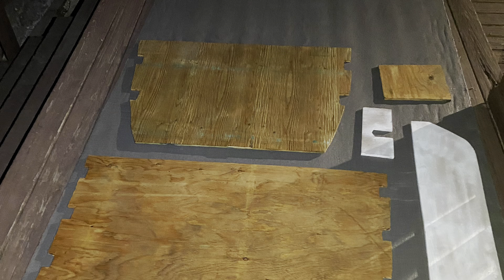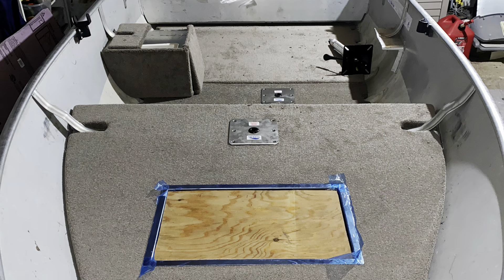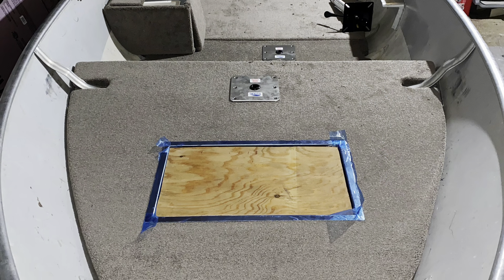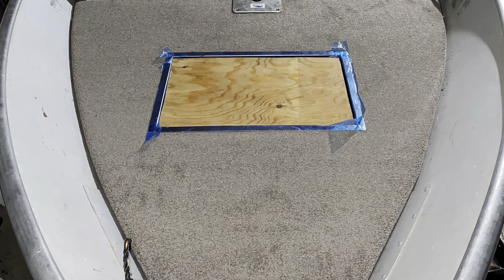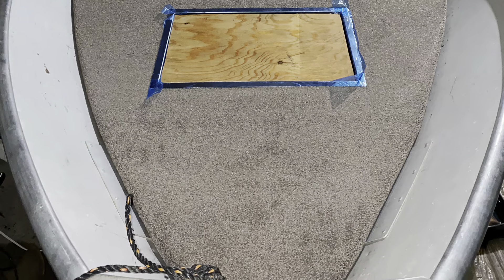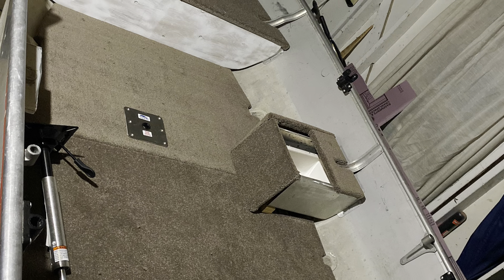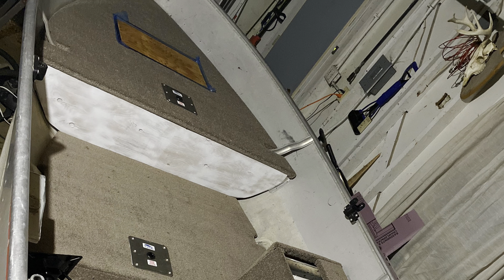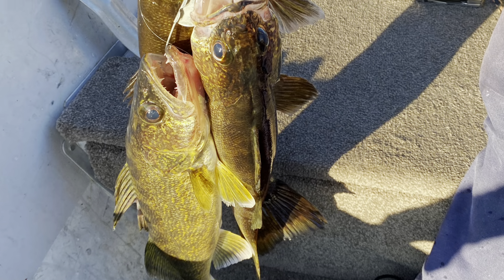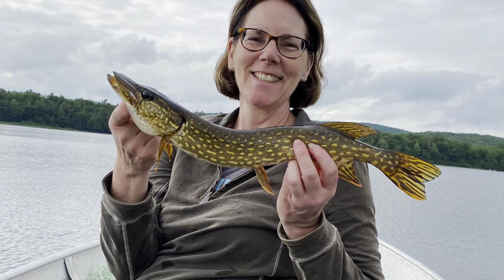For finishing work, I chose to carpet my pieces. You can paint them, you can leave them bare wood — you can do a lot of different things — but I chose carpet. One thing you're going to want to take into consideration if you do choose carpet is you're going to want to trim all your pieces of wood down to about a quarter or half an inch smaller than what they already are to account for the extra space the carpet's going to take up.